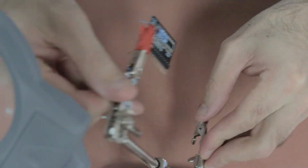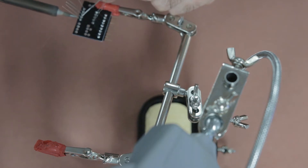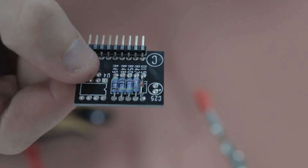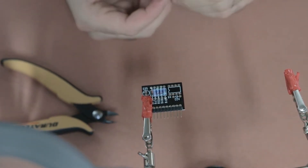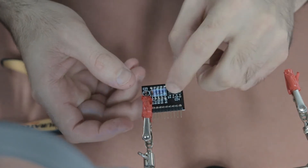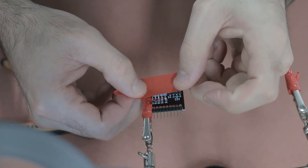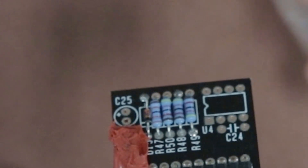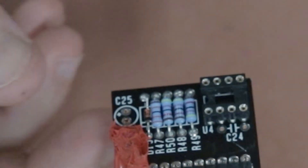Once you've got these smaller components in the board, you can turn it over and start soldering the legs. If the legs are a bit close together or tricky to get to, you can snip some of them and then solder the rest. Then we need to solder in an eight-pin IC socket — we've got a couple of IC chips we're going to put in later, but we're just soldering the socket in at the moment. This also has an orientation, with a little dip on the circuit board showing where the cutout on the socket needs to sit.